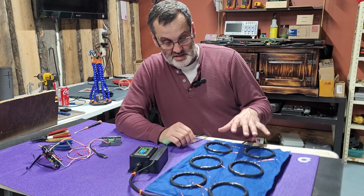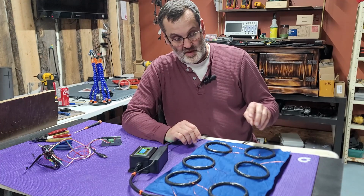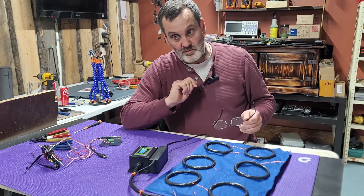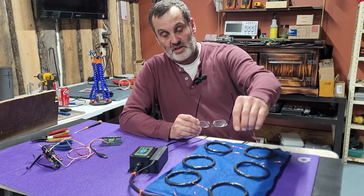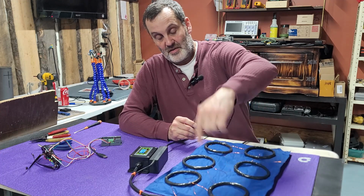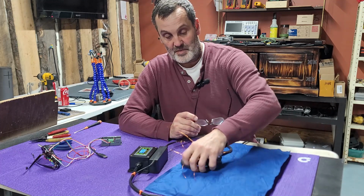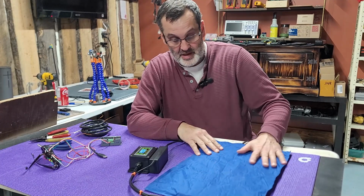So when I put the rings up there, and you've got a series this way and a series that way, I'm gonna put 2 LEDs, one on this series and one on that series. Those LEDs don't have enough amperage; you cannot flow that kind of amperage through them. That would be awesome if I could, but I can't. So I'm just gonna take one leg off of one and parallel them with this. As long as there's flow in there to go back to ground, it'll be fine. Same thing on the other side. And as long as both LEDs are flashing, we're monitoring the coil. I'm gonna play with that, and if I can figure out an easy way to do that, I'll put that in the video and we'll talk about that.